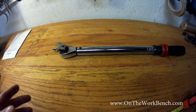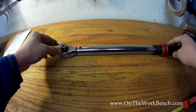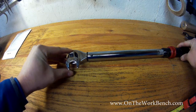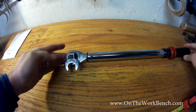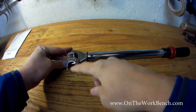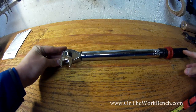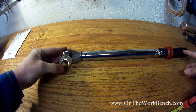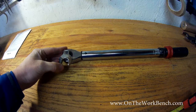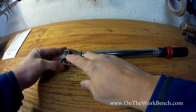So how do we fix this? The important distance is from here to here. All we have to do is turn our crows foot wrench 90 degrees, just like that. Now, from the center of our fastener, the centerline times the distance is going to be our same 16 inches, and we will be just fine with our torque spec — we'll get whatever we have our wrench set to. For my example here, I was talking about 20 foot pounds. So all we have to do is turn this 90 degrees.